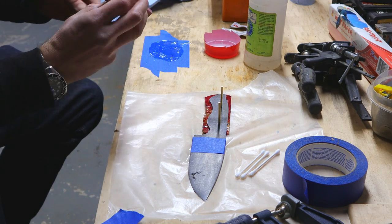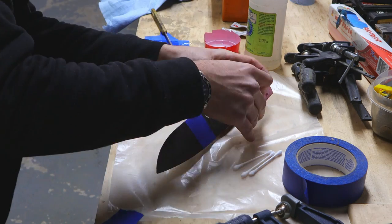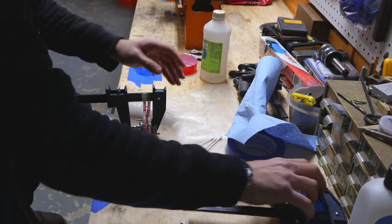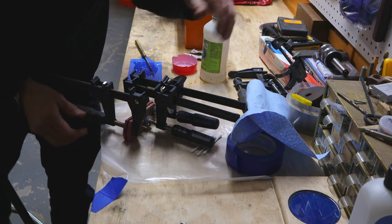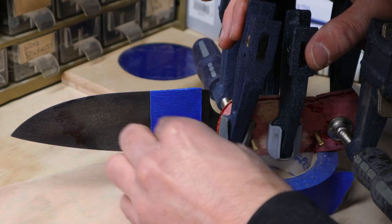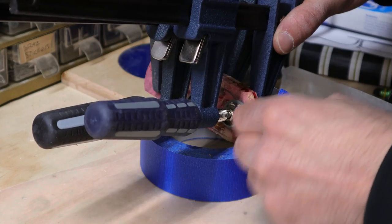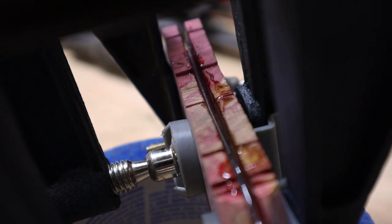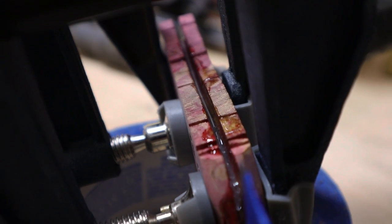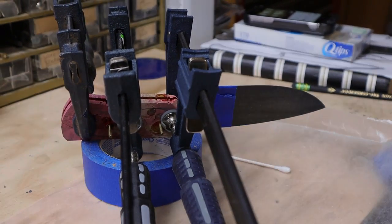Then I cover the second piece of the handle evenly in epoxy and then put it all together. Make sure you use at least 3 clamps to secure it up nice and tight. Here I use a Q-tip covered in rubbing alcohol to wipe away any excess epoxy that may have squeezed out on the blade while clamping. Remember when using glue and clamps not to tighten too much and have the epoxy ooze out. You want it to do its job and hold everything together.